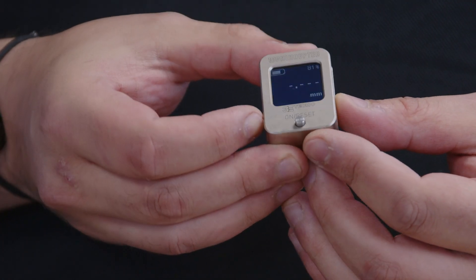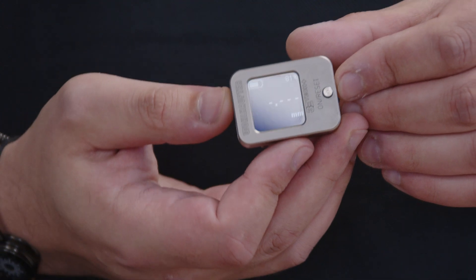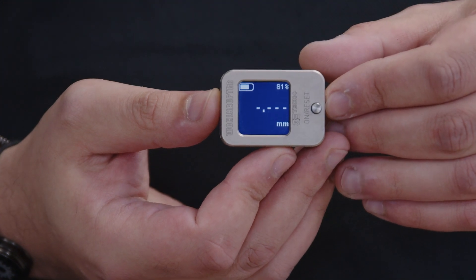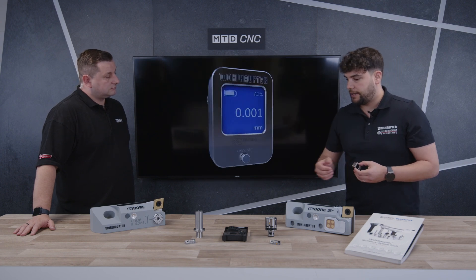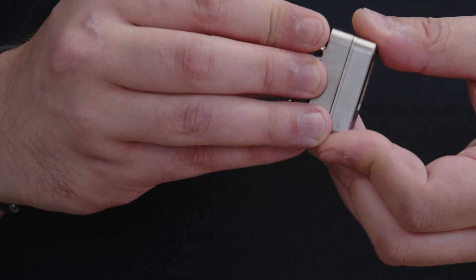This is version two of the digital display — so what advantages does it give over the older model? The old one was able to adjust to two microns on diameter; we now have one micron on diameter. If you rotate the display for a vertical or horizontal application, you don't have to bend your head anymore. It's rechargeable so you don't have to change the battery, and it comes with a docking station. To fit it onto the cartridges as well as the boring bar — for the standard boring bar you can just plug the display onto the tool, and for the cartridges you just need one of those adapter plates.